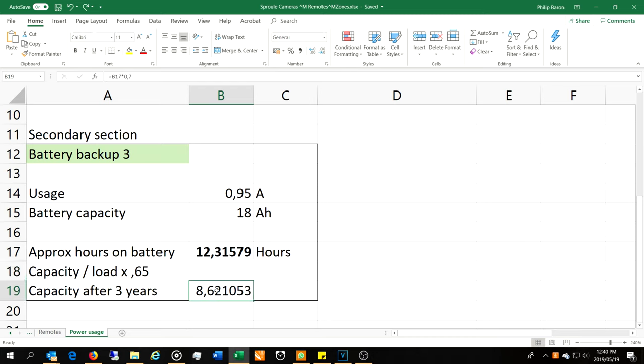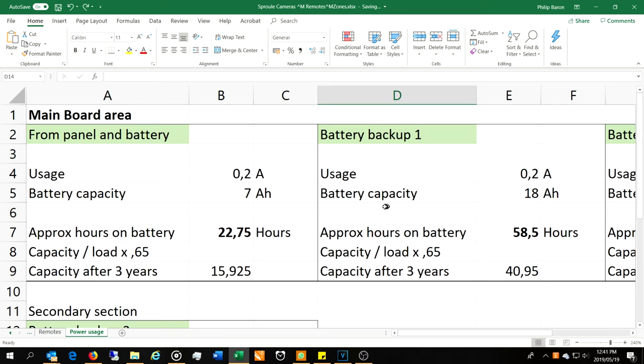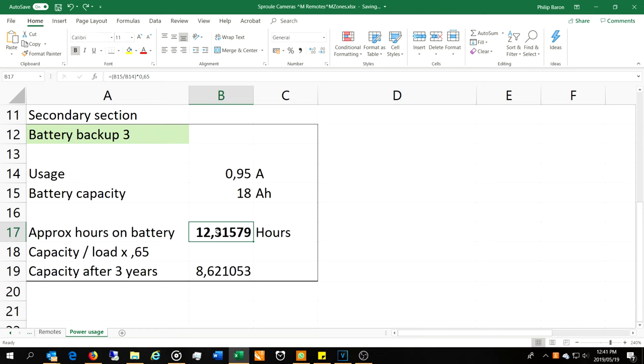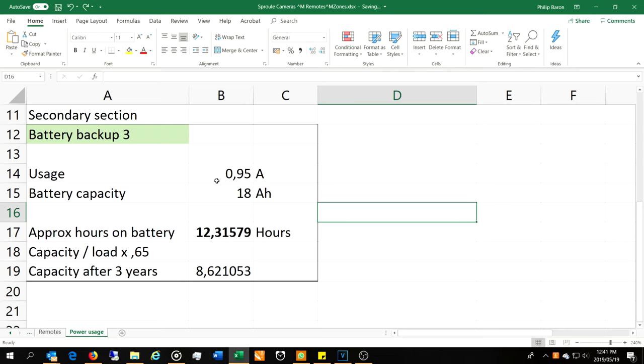Then, keeping in mind that as the battery ages — depending on how you've used and charged it — let's drop that by another 30%, so I've multiplied by 70%, keeping in mind you could probably drop it by 50%. So these are best case scenarios — about 12 hours on that one battery backup supply at 0.95 amps current drain. The goal here is to reduce that drain so that we can almost double the backup time. We need to share that load onto another battery power supply. I have a spreadsheet with different battery banks in this installation trying to match all the backup times, and I'm going to show you how to do that.